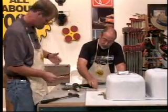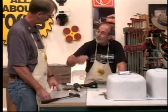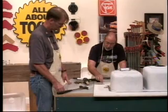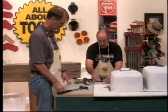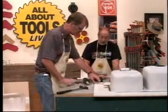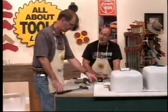But what's going to happen is you're going to put it on like that, and then this actually comes up. It reminds me of the old Mattel toy where the Play-Doh comes out. It comes out like that, like a little extrusion, and then it mushrooms over, and when this dries, it's permanent. And then you would take one of these clips that comes with it, and your wing nut, and fasten it down in much the same fashion. The difference here is, and John's 100% correct, the epoxy is what holds this in here. It's the little knurls on the ferrule that hold that down.